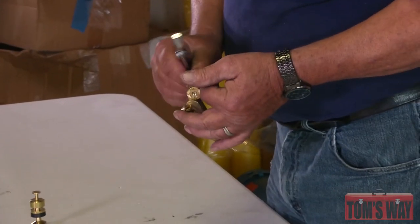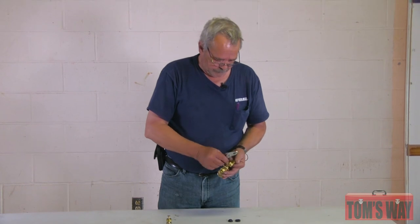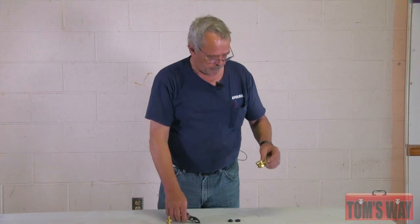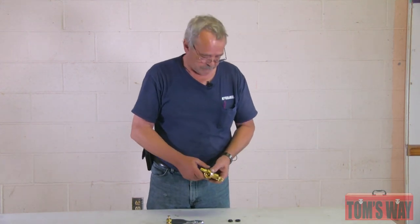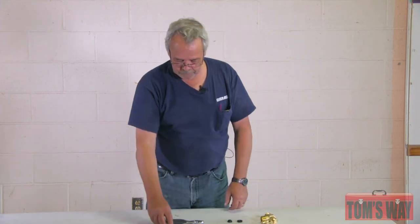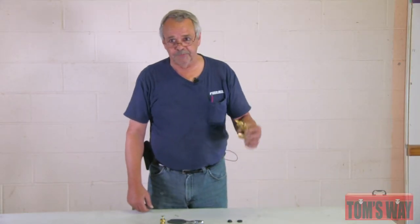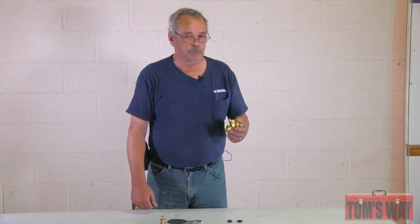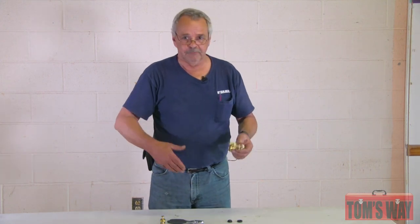The reason you're going to fix these is because they're leaking, not shutting off completely. You come in in the morning and your tank's overflowing — that's a pretty good determination that it is leaking. This takes a grand total of about two minutes, whether you're putting in the kit or putting in the new plunger. Simple and easy. It's a lot cheaper to fix it than to buy a new one — this is one time I'll actually advise you to fix something with a kit rather than just throw it out and get another one.